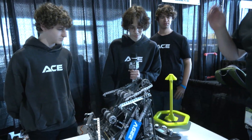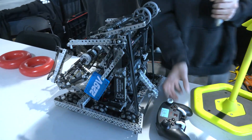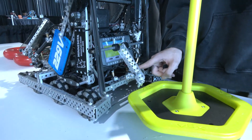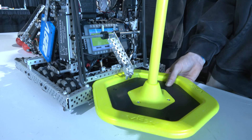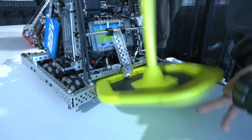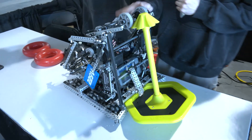Let's dive into some of the aspects of this robot. Jacob, talk to me about the back clamp, the intake, and other great things on this robot. Sure — our back clamp is really simple. We use 25 millimeter pistons on the back clamp, assisted with a band as well, and we have these little bent standoffs that perfectly morph around the goal to guide it. For autonomous and driver, it's a simple button press and it goes right up into our hood trajectory.